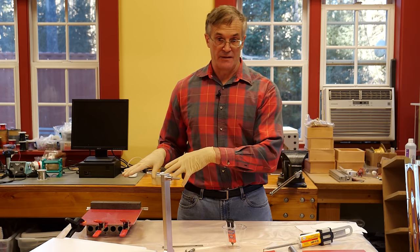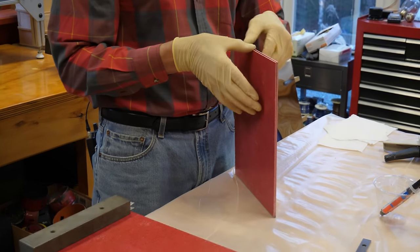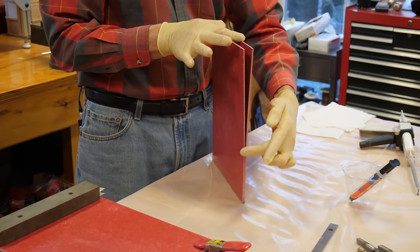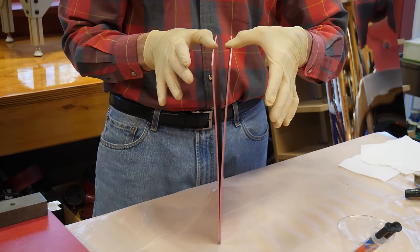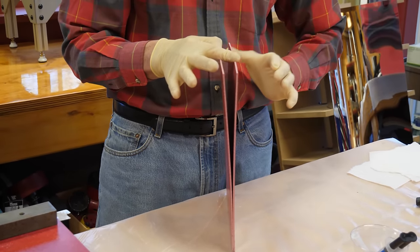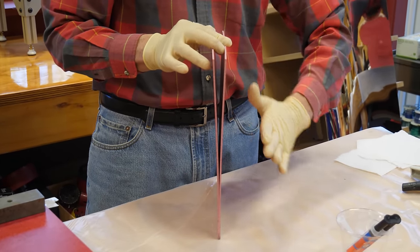The end result after a night of drying is something like this. If I pull these apart you can see that the trailing edge remains parallel, so I tend to get a hyperbolic curve out of this. And that makes this far stiffer than it would be if I built a triangle, because the panels themselves, as they're rounded, don't want to bend at the trailing edge.